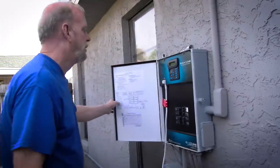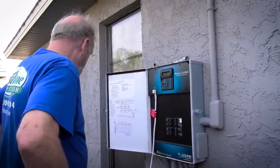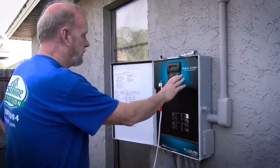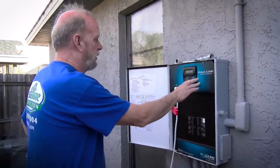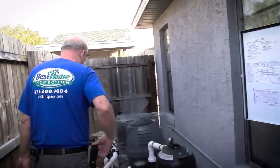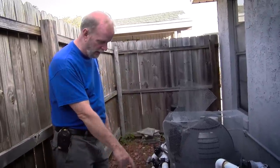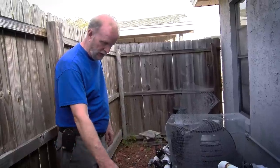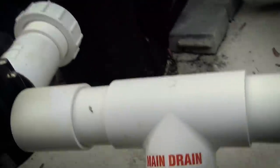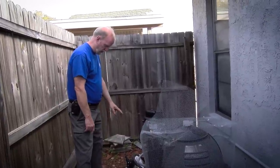This here is the control panel. I can see it just told me the salt level was 3,900 — that's a little high but that's okay because it was just treated. So let's go ahead and turn the filter on and we'll see how everything runs. I can see that all the drain lines are labeled: the pool cleaner, the pool skimmer, the main drain, the spa, the spa return, the air blower, and the pool return.